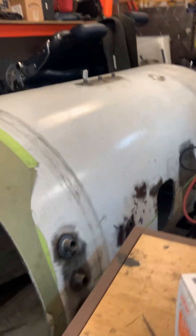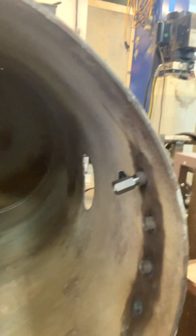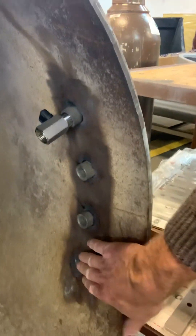We also put in the bleeder valves — the entrance and exit for the bleeder valves. We're going to put them on the inside of the tank because I think it's better; the other ones I did were on the outside, but it's easier to work from the inside when you're operating under pressure. The bleeders will be on the outside but the shutoff valves on the inside, and the last one is going to stay just a bleeder set at 30 PSI so that it can't go higher than that.